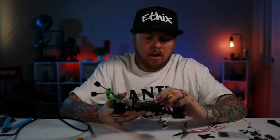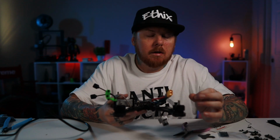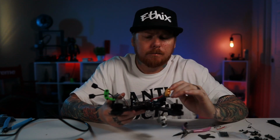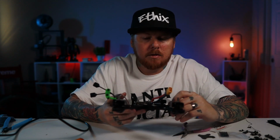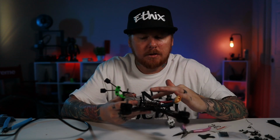But as always, soldering is a little bit of a difficult task to learn. Just practice. There's tons of boards out there that you can buy for really cheap. Practice it up, and less is always more with soldering. Just make sure you get it all heated up. Use flux. Use a good rosin core 60-40 solder, and it shouldn't be too difficult at all. It's all about technique, and once you get the practice going, it's pretty simple. You always want to see the nice puddles all nice and even. You want to make sure your joints are all good to go, no cold joints, and that's about it.